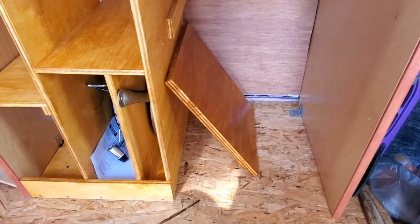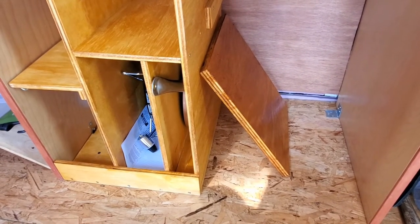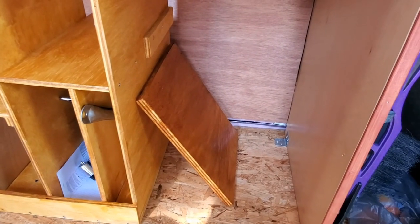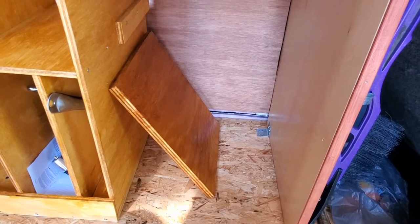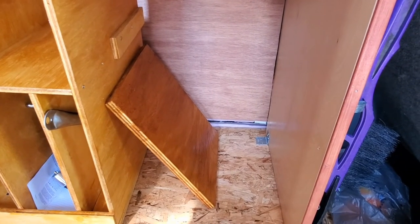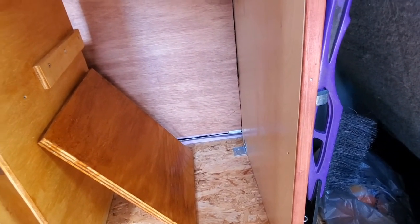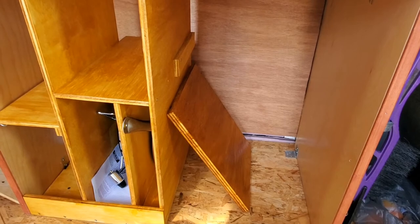Now the problem with this shellac is it's difficult to use. It's a very thin liquid and it splashes all over. And it also dries and hardens very quickly. So if you lay some down and then you want to go back and brush over it, it might be in a semi-solid condition, real gummy, and it doesn't take a brush too well after you've put it down. So it was a little difficult to use, a little sloppy, but I like it. I like the look of it. One coat will be enough.